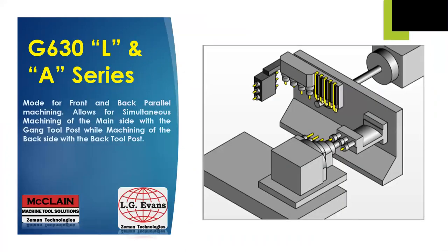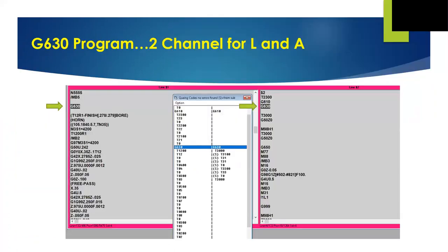G630 is defined the same when moving to our L-platform machines. This time, however, there's only one tool post for the front — the gang — and one for the back — the back tool post. As seen in this screenshot of two-channel code, it's just G630. The front begins machining with tool 12 — in this case a boring bar — while on the back side, an M98-H1 subprogram sends the control to a subprogram which directs the back machining. In the queuing window, we see operations with an S in front showing machining with tools 31 and 33 on the back tool post. We like using subprograms on the back side because of Citizen's proprietary last-part program capabilities. This way we don't have to write out the back machining code twice even though we use it twice — first to machine the back side in continuous running, and then when we access it again after cutoff in one cycle to finish the back side without starting another part.